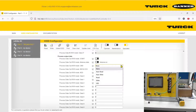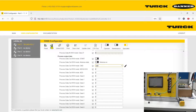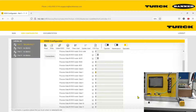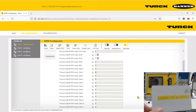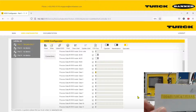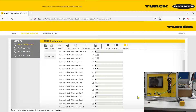We're going to try reading the UID of the RFID tag. Click the Command field, change it to UID, and then click Write. While it is set to UID, you can see I have an RFID card here. You can see the UID of the card. If I scan it, you will be able to see the data appear.